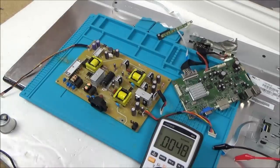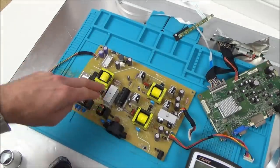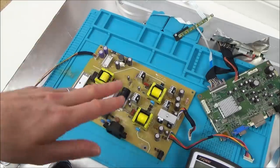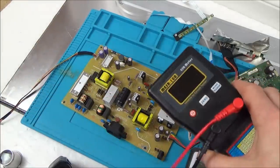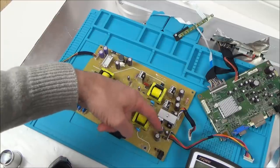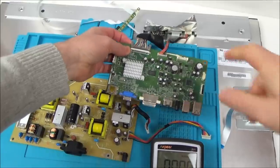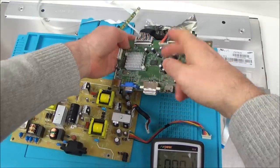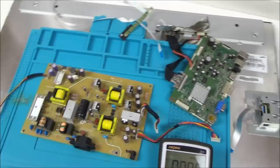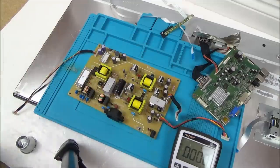I started concentrating my efforts around here. Various MOSFETs on the heat sinks and various resistors and capacitors. I ESR tested every single capacitor on here - it's a really nicely designed board with all the negatives up the top, so when you flip it over it was really easy. I even did an ESR check on this board here too. They were all showing as good cap with low ESR and none of them are bulging either, so it wasn't a problem with that.